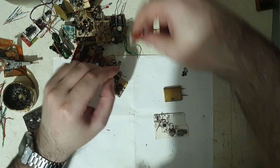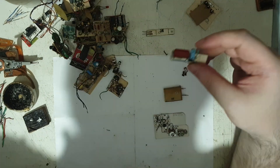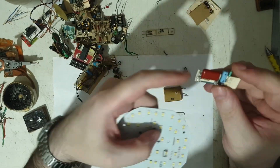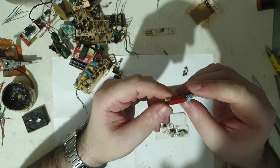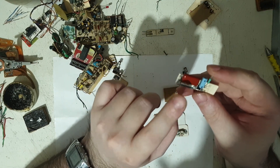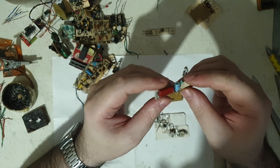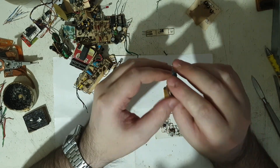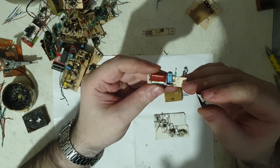Now for my newer circuits. This one runs on 220 volts — I put mains voltage here and it lights up those scrapped LEDs. I can light three or four with one circuit like this, depending on the capacitor. This one has a 100 nanofarad cap, but if you use 200, 500, or even 1 microfarad you can drive many more high-power LEDs for illumination. These are the new generation of cardboard circuits.